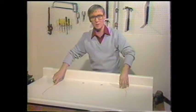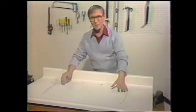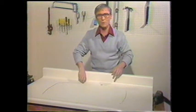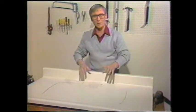as I've just completed. Then you'll be lifting this center piece out, but before I do that, I'd like to show you the holes. Remember, we marked them on the template, and you've used a 3/4 inch or 1 inch bit to drill the holes so that you can set your taps in.